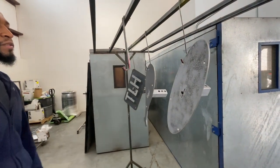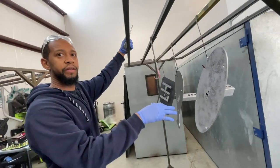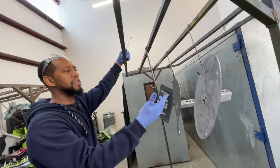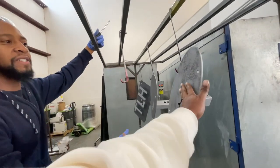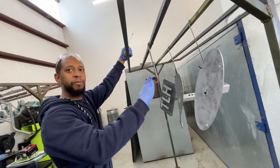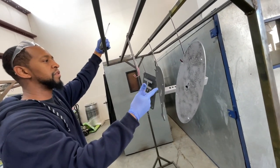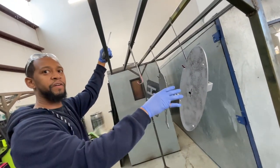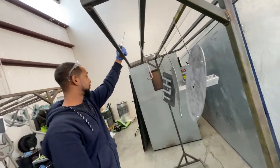What color is this one going to be? It's going to be red and then black on the other layers. These were actually sandblasted yesterday. What you see on here isn't rust — that's actual coating from the original metal; they put that on there to keep them from rusting. We blast everything else off, then hit it with an air gun and a torch to make sure there's no moisture, then go straight to coating and into the oven.